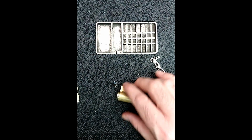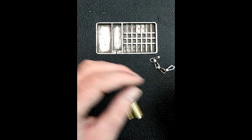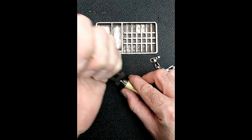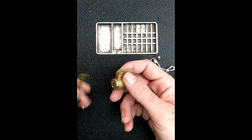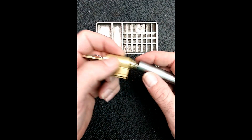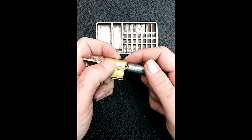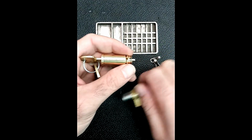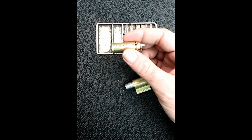Alright, so taking it apart, it's rekeying just like any other cylinder that you would rekey. You got to get your clip removal tool, pop that off. Thankfully we got the key, so we can just go right on in there. There's no need, in this case, to remove the follower or the tailpiece. That could be kind of a pain in this situation. So there's a cylinder, there's a shear line, all that good stuff.